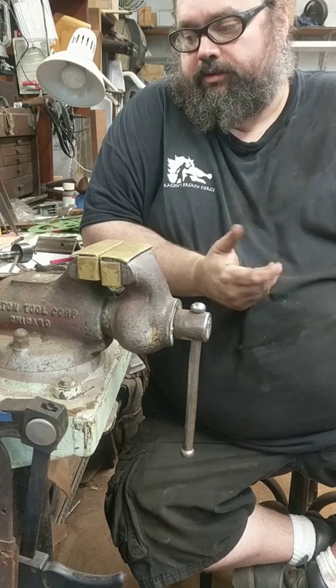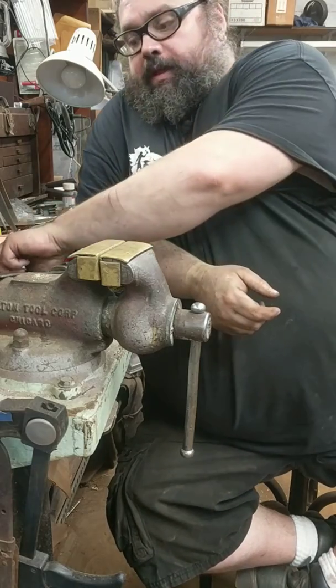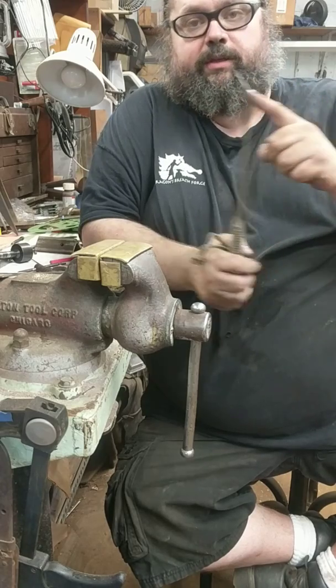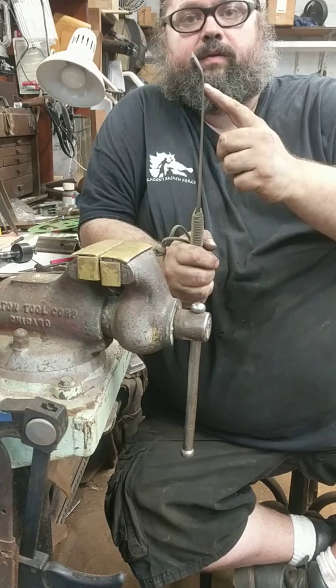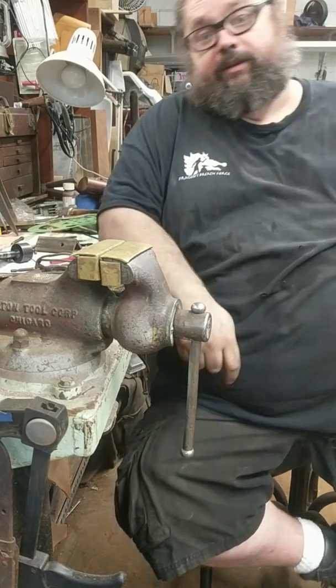This isn't to say you can't do it the other way — which is to do a fairly thick knife and either edge quench or draw the spine down dead soft, and just accept that the knife will bend. That's fine, but it carries an inherently larger number of risks. When it kinks like this, all of that strain is concentrated right at that one point instead of being distributed over the length. The distributed bend is much safer. Anyway, thanks for watching guys.